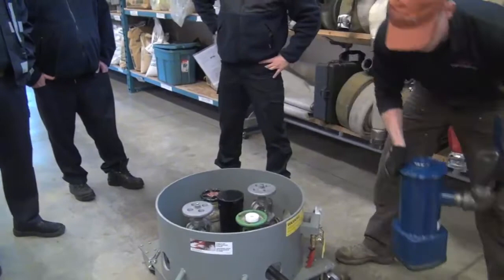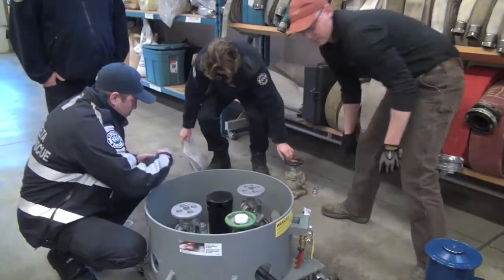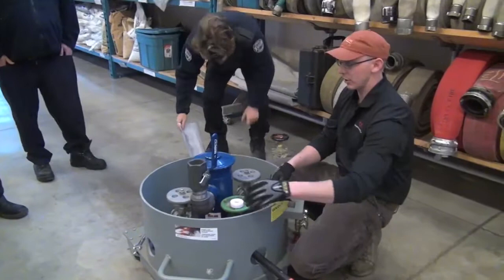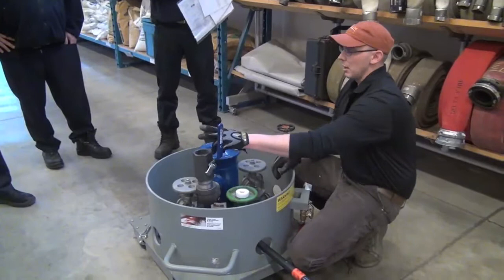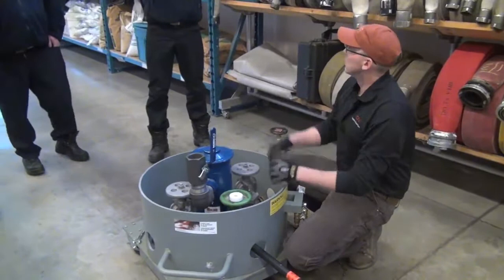So the can drops down in there. A couple other things to think about depending on the fittings you have and how far into this you want to get. The valve is open here - depending on how bad the leak is, we're discharging whatever vapor here. The guys actually up there doing the work may really appreciate you taking an extra five minutes to pipe fit from this to a barb and run the product into a hose. Even if we don't have a solution to scrub it, at least we can get it out of their face so they can work without an active leak right there in front of them.